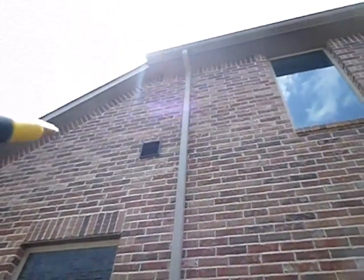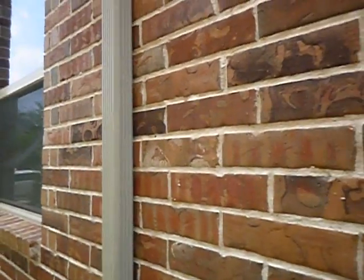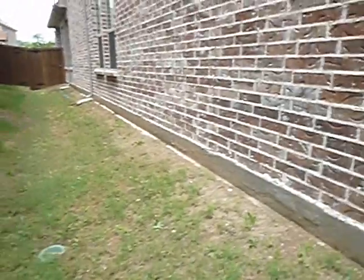On along. See that grill right there? It's a tight house, so that's a fresh air induction grill. So fresh air can come into the house, so you have a healthy house. Now, in some parts of the country, these grills are not supposed to have screens inside of them. They can freeze over and starve your furnace on the coldest day of the year. But our coldest day of the year won't do that. Our problem is with birds.